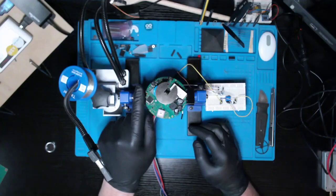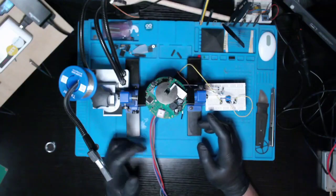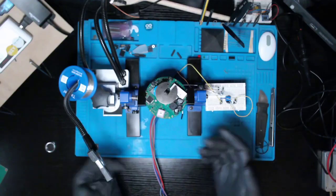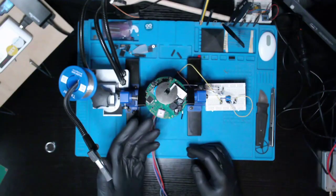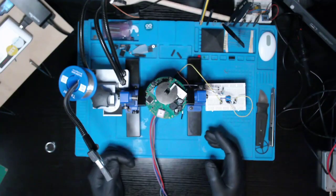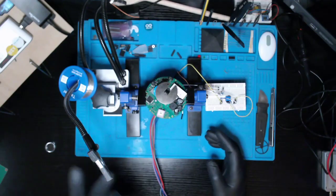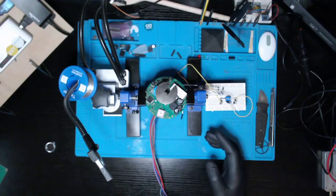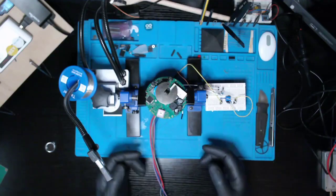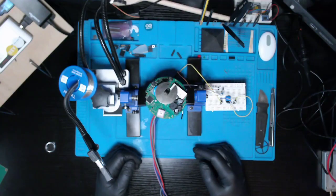I have had this Telensa unit for a while. I was initially like, well, do I have to do another lamppost video? The other one was really conclusive. I tore it down. I disassembled the 8051 assembly language. I showed it in operation. I reprogrammed it so the 64-byte payload would keep repeating, so I could show that on camera. I showed the voltages in various parts of the board, its separation.